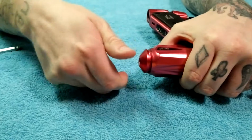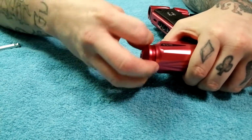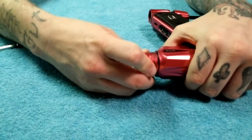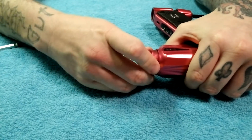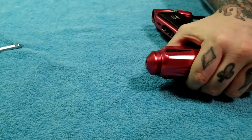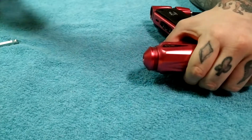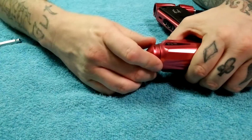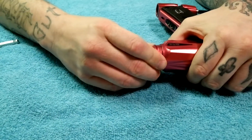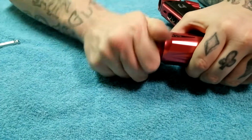The reason why is, if you try, I'll go ahead and back it out and show you. If you try just to slam it in there and start turning, it's going to start giving you issues. The reason why, it is not grabbing the threads. So at this point, if you start torquing it, the only thing you're going to do is completely destroy your threads. So we'll back it out again. So same thing. Get the O-ring in first, then slowly start to turn it.